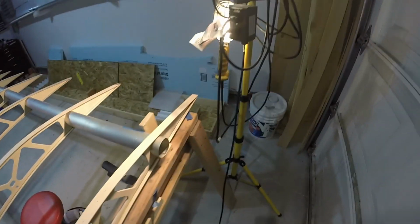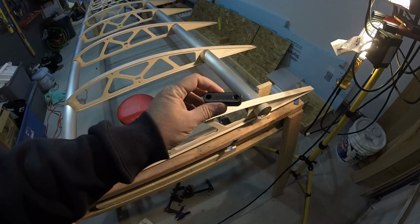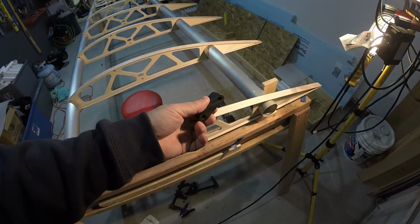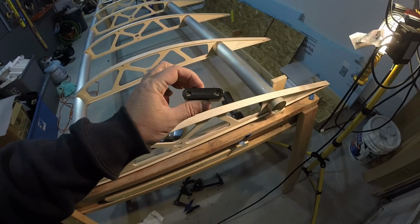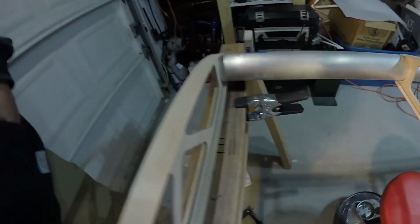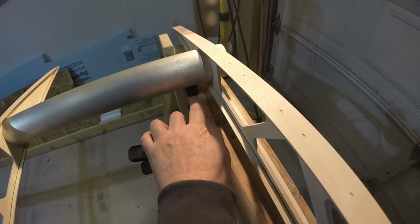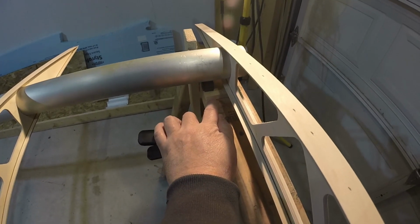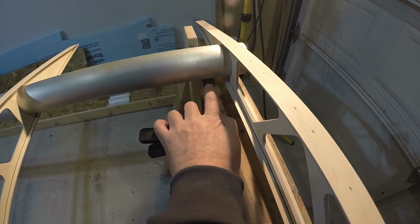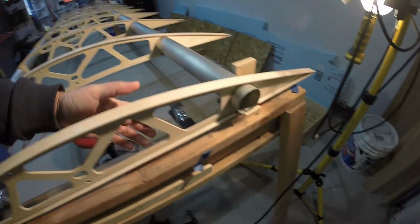So pull this out because I got an extra one. These are some aftermarket motorcycle parts I made, windshield spacers. They're CNC cut, quite accurate in thickness, and so some of those extra parts came to the rescue here. You can see I have one, and this is the spot I was worried they weren't going to work, but it actually came out just fine. My 1/2-inch spacer block for washout. Then I have the nylon block here, UHMW actually, and that allows my rib to float exactly like it's supposed to.